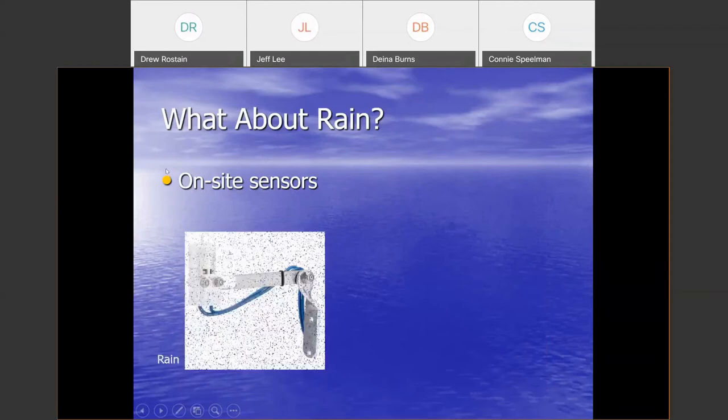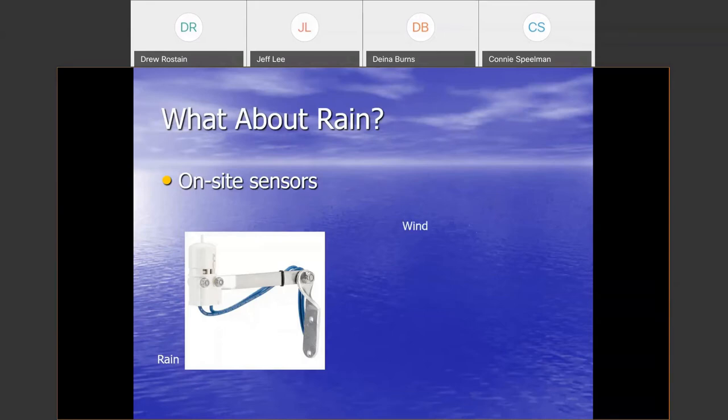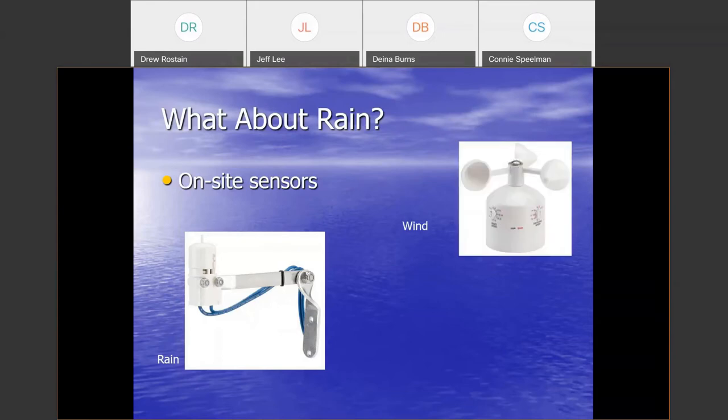You can use on-site sensors, and one of the most useful for smart controllers is a rain sensor. All smart controllers have a way to connect a sensor — you just need to tell the app it's there and what type it is. Then when it rains at your house, the controller responds to that, not to rain at the airport. Wind sensors are also available — handy if you're running sprinklers and don't want them operating on a windy day when water just blows away. The only problem is that because we typically have a good amount of wind in our valley, you can end up always playing catch-up with interrupted irrigation.